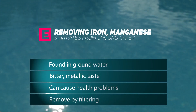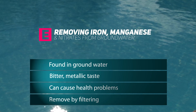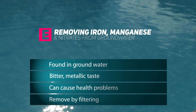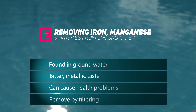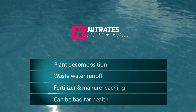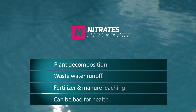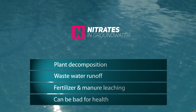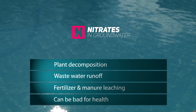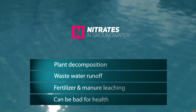Manganese requires the same treatment. Manganese is found frequently in groundwater — it can give water a bitter and metallic taste and under certain conditions can cause health problems. Manganese can also be removed from your borehole water by using a filtration system. Nitrates occur in groundwater when plants decompose in the soil, but often also occur because of human influences such as wastewater runoff and the leaching of fertilizers and manure. Nitrates can have negative health effects and the common treatment is to filter the water.